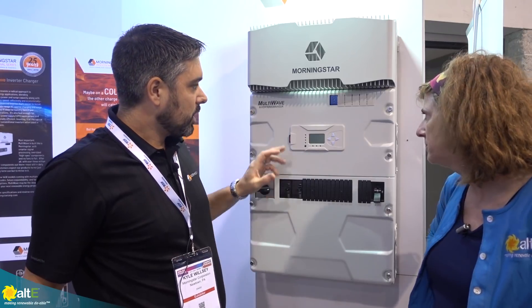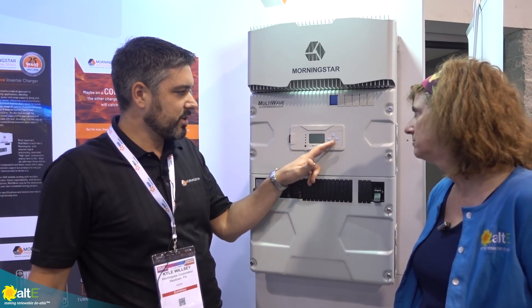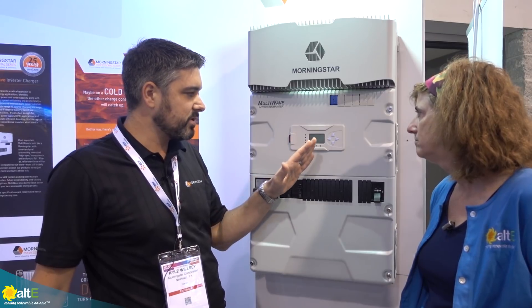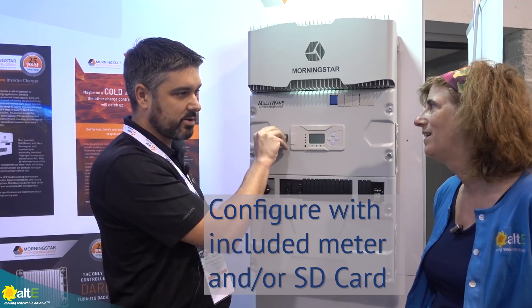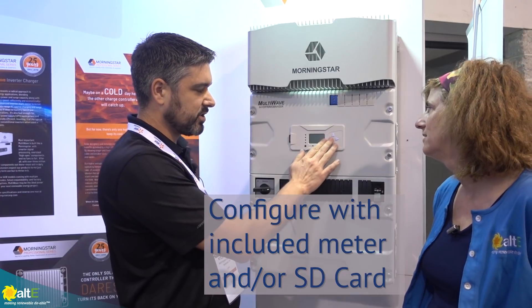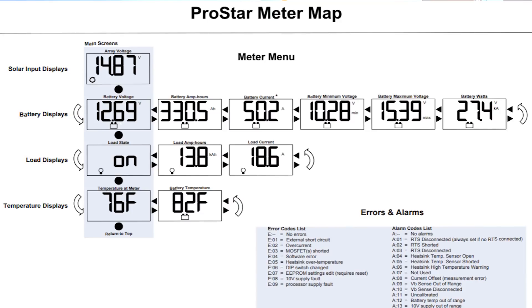So tell me about the display setup here. We decided to include a standard meter in every model so you never have to worry about adding it as an option. The four-button interface is similar to what we've designed in some of our charge controllers. You'll only need to use it briefly during commissioning. Most of the setup will be done through an SD card that can be configured ahead of time, brought to the site, and then the meter becomes just an interface to download the settings files. That will save a lot of time on site — no more memorizing menu positions — though it's still there if you need it.